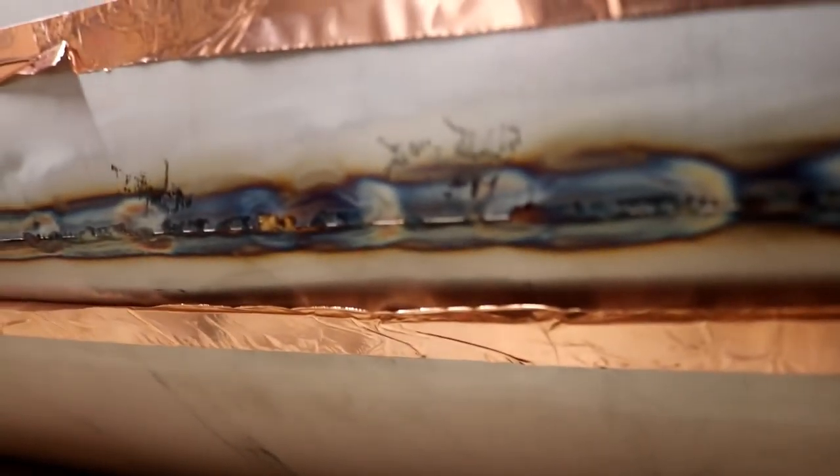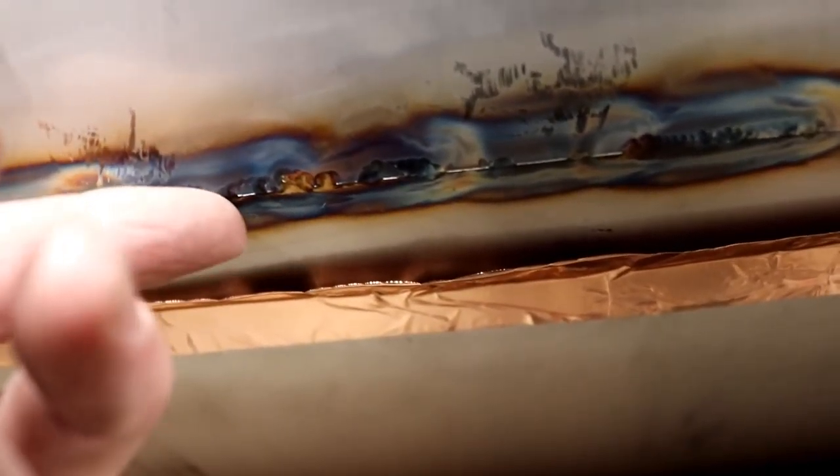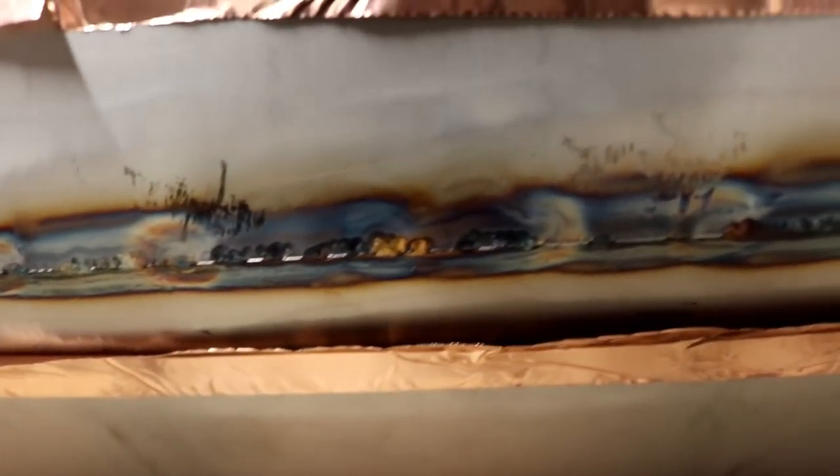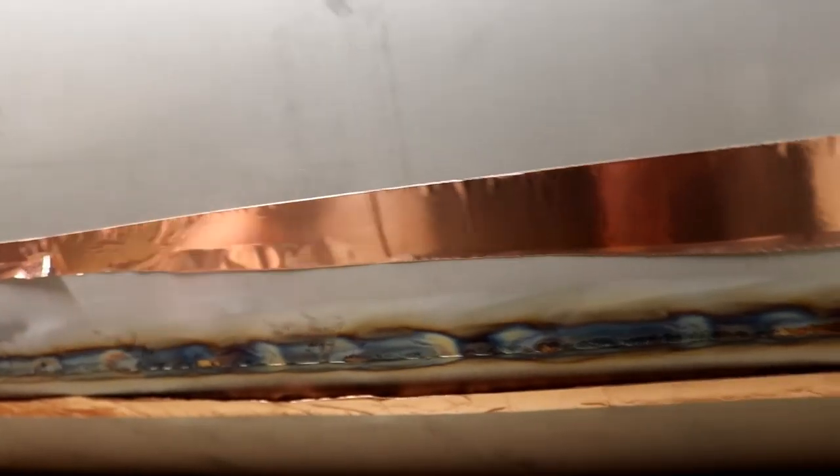We've ripped the back off. If you have a look, apart from some blueing, there's no coking — apart from maybe this end, which is the furthest away where I had to unwrap it. There is a little bit of pointiness, so I'm hoping I can run down with the TIG torch and just re-flow these few bits to take that little ridge out. The fit wasn't perfect on that section, so what do I expect.